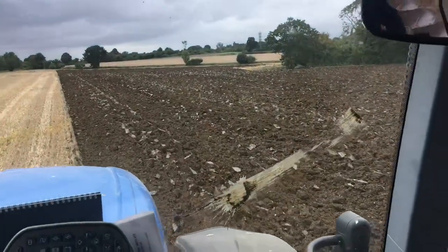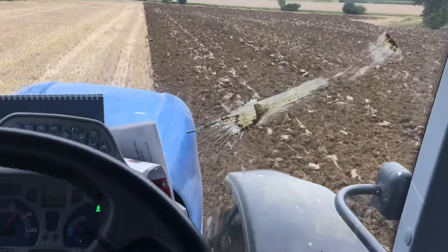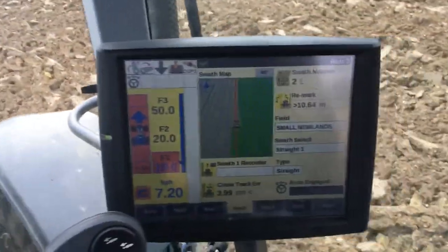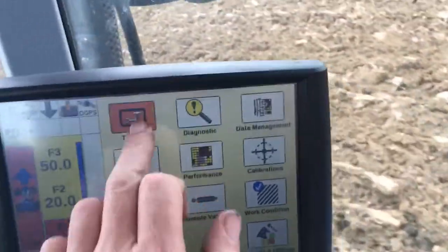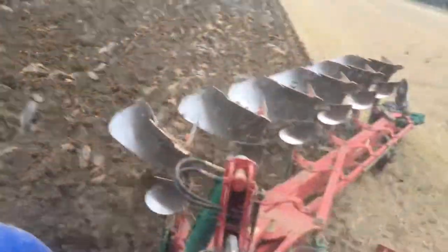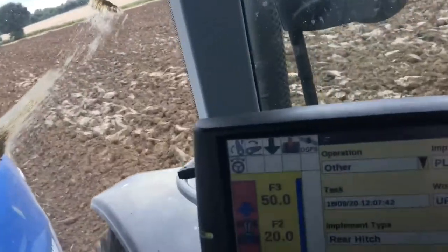Here's a video on ploughing. Can you plough in the furrow with GPS? Well you can, as long as you get the furrow width right. I've got it set at — you'll be able to see all this in the toolbox — 2.75 metres wide on a six-furrow reversing plough, which is just over 18 inches of furrow.